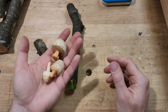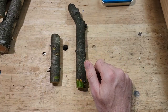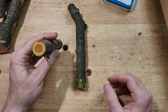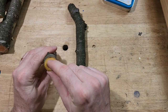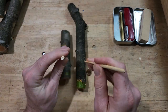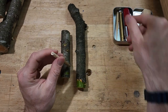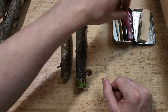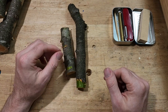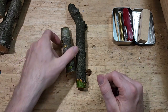These four are all carved, even the big one, from buckthorn. And that's what I have here that I'm going to use today. I like to use buckthorn just because it's invasive so I don't have to feel bad about cutting it down. And then I can have some green wood to use. It also works well because it has a solid pith. When ash branches are small, they often have soft piths. You don't want to use a pithy wood to make a top because you need the center to be pointy for your top to spin. So stay away from woods that are pithy. You need a solid wood with a solid core. Otherwise you can split yourself out a piece of a log if you can only find bigger stuff to work with.